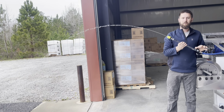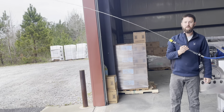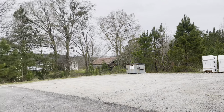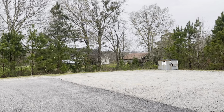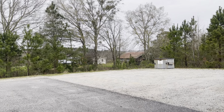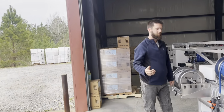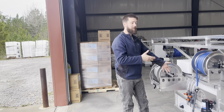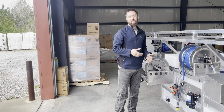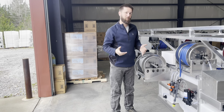All right, listen to the pump. It's trying, pulling that air out, getting some performance back, and okay, cool. So it's not that line. We can tell by the distance that we're spraying that it's not that one. Okay, so we know that one's fine. And we could just start opening valves one at a time to kind of see, when we open the next valve, does our problem come back?